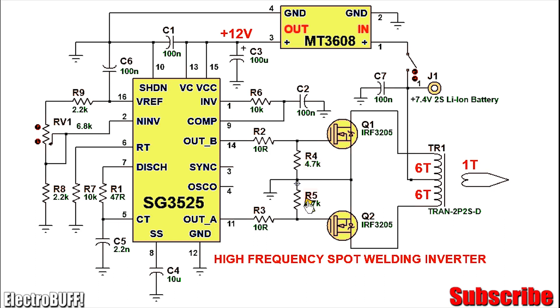Resistors R4 and R5 are gate-source discharge resistors. They ensure that the MOSFETs are completely turned off by discharging the gate capacitors so that the MOSFETs switch properly. R2 and R3 are current-limiting resistors to limit the current flow from the IC to the gates of the MOSFETs, which if left uncontrolled can damage the IC. They are rated at 10 ohms and 1 watt. R4 and R5 can be anywhere from 1 kilohm to 10 kilohms — they will all work fine.